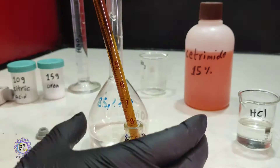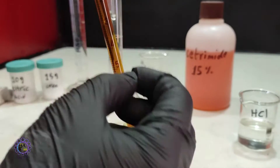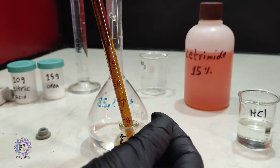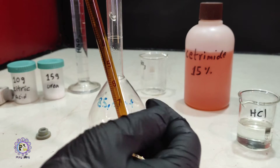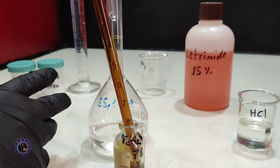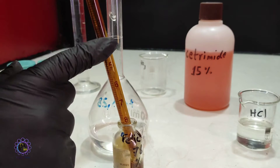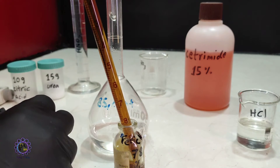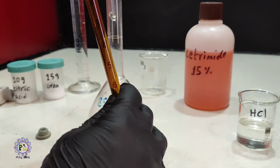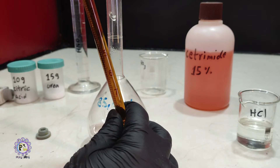There is something worth mentioning about why I'm using ferric nitrate solution: the solder covering the copper on PCB boards or gold-plated pins forms an alloy with copper — specifically a copper and tin metal alloy — which is hard to dissolve in hydrochloric acid and urea-based solutions widely used by refiners. So I add these two components to accelerate the process and dissolve the copper-tin alloy that forms over time as the PCB ages.